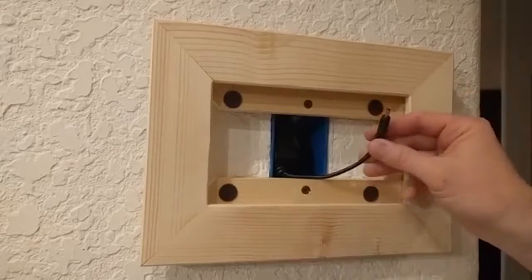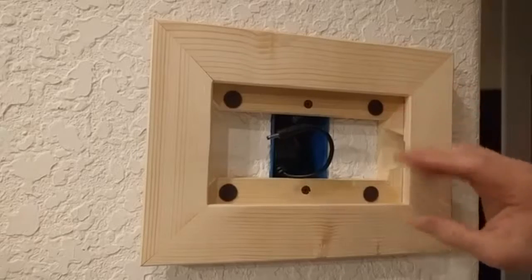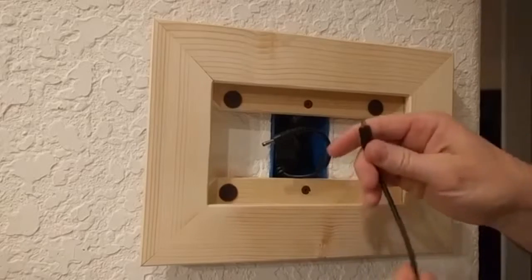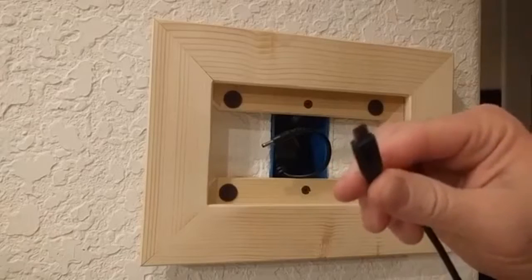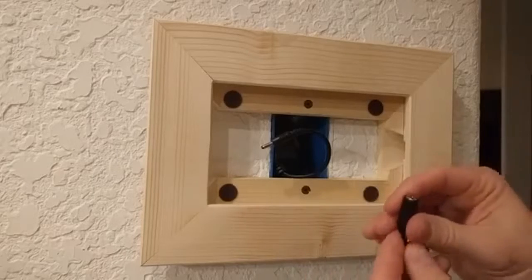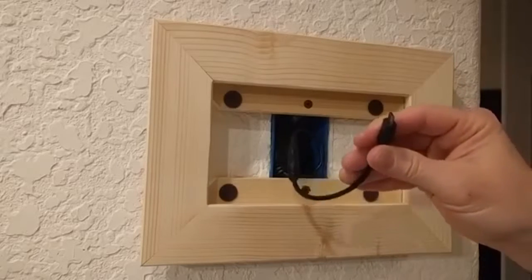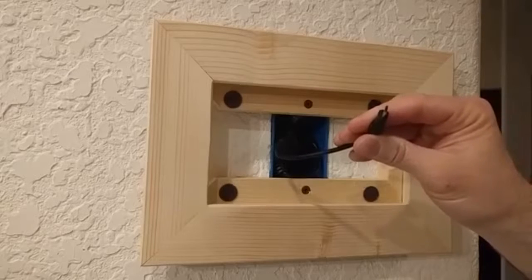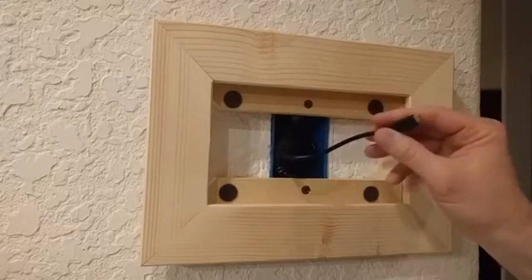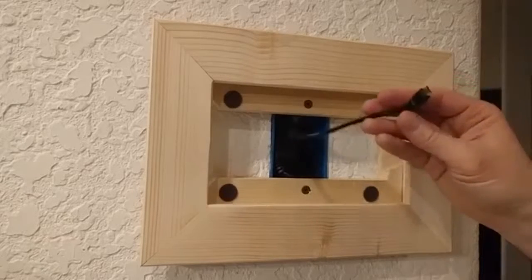The only thing you should have left out here is your power cable. In this installation, the tablet slides into the wall mount. We're going to use a USB micro straight — you can see the connector is a USB micro that is straight on, no 45-degree angle on it — and the other end has a female plug that connects to the power cable. We do carry these in USB micro, USB mini, USB micro 45, USB female, and the Apple 30-pin. We have all those on our site and you can mix and match, pick whatever you want for your type of installation.